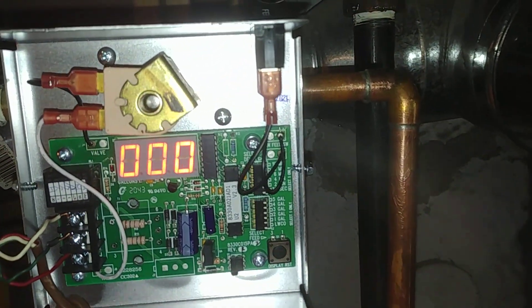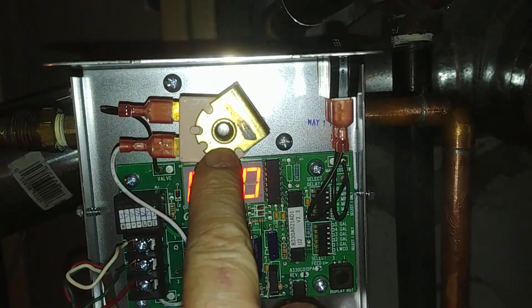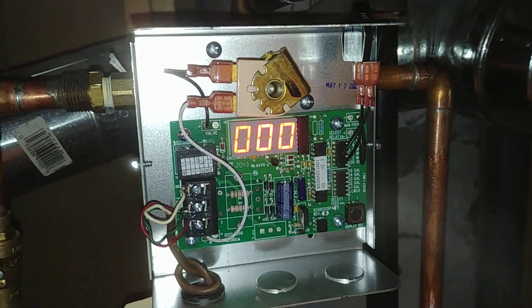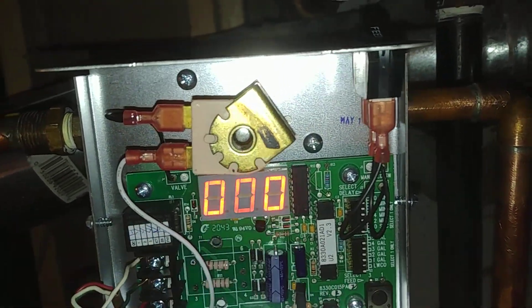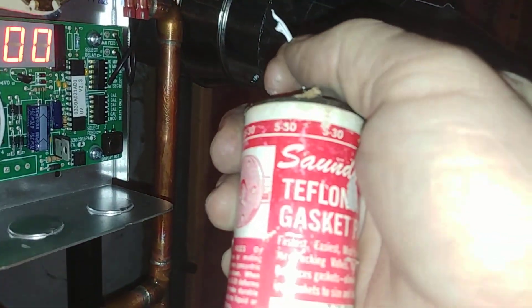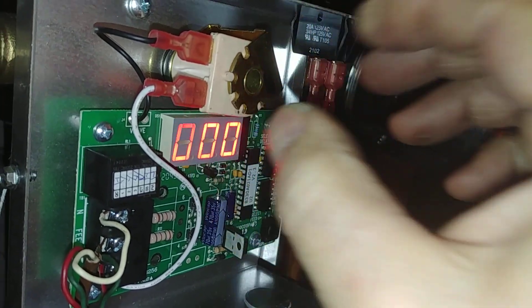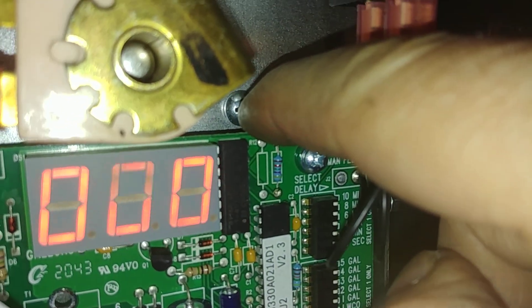In this particular case it was a transitional unit in that they didn't have the coil properly mounted. What can happen is the coil can come loose and burn up because it's not getting the cooling effect of the stalk that's in the middle. What I usually do is shove it on with a little teflon gasket inside and just push it onto the stalk so that keeps it from coming off easily.